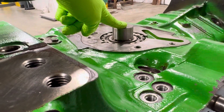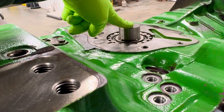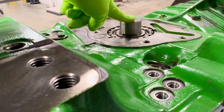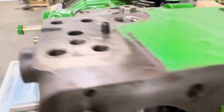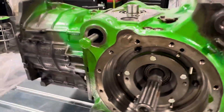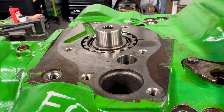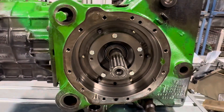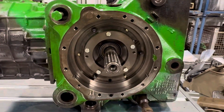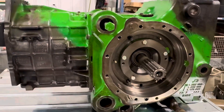The hydraulic pump image tells us whether you have a pressure-compensated or a pressure-flow-compensated pump. Pressure-compensated is typically on your lower-end tractors like this one; pressure-flow-compensated is more on your premium-level tractors. We see both break, but most are the pressure-compensated — there's no design difference between them, it's just the amount of weight and extra equipment on the side of them.